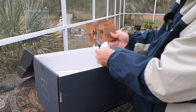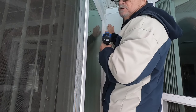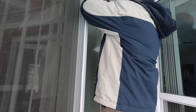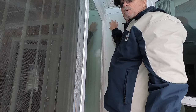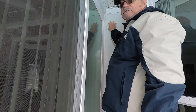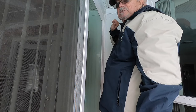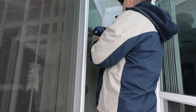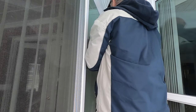I'm going to move the camera over to our first hole and we'll do some drilling. I'm going to drill a pilot hole first, all the way through the wall - it's about three and a half, maybe four inches through the wall. I can feel that going through. I think I actually have four layers of this metal paneling to go through. I'll drill the large hole from the outside and go inside to drill from the inside as well. I went inside to check the pilot hole to make sure it's where I wanted it - and it is. Now I'm going to try the three-quarter inch hole from inside.